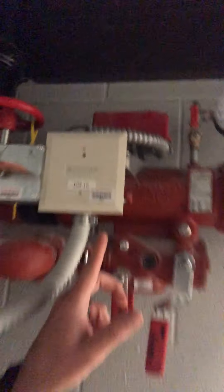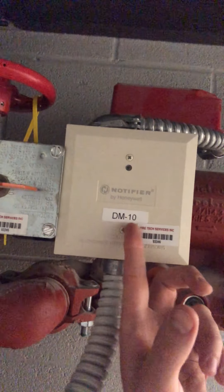Just another feature — you're not going to see them on all indicators — you can see right here it says DM10. That is the module ID number and it's going to communicate with your fire alarm panel. So if I were to shut this valve, or the water flow switch activates, these module IDs are tied to pull boxes, valves, and tamper devices. That module ID will show up on your fire alarm panel — so it says 'water flow first floor' and you might also see module ID DM10 or PS5, whatever the case may be. That is that specific device communicating with the fire alarm panel to let you know what's going on.